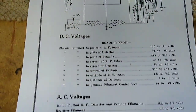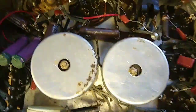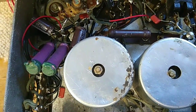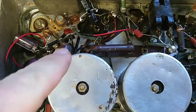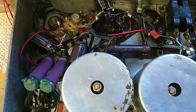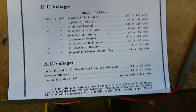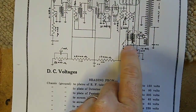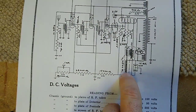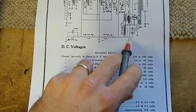I'm looking at the readings, and I noticed that pretty much like I thought, they were all a little bit low. Someone's been in here before myself, and you've got this big control dropping resistor over here. The high voltage coming out of the rectifier that I have tacked in there is actually decent - it's just a hair around 400. They say the AC is supposed to be 375, it actually measures around 387, so it's a little high there. But after the rectifier, we go into the field coil for the speaker - it's 2500 ohms, actually measures 2480 something. But on the low side of this, we've got only about 178 volts right now, and according to this it should be around 215 to 235. So there's a lot of drop going through here.